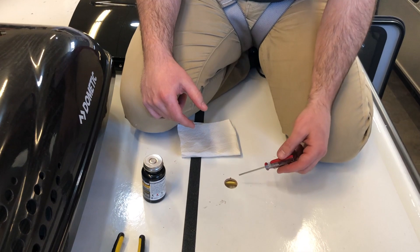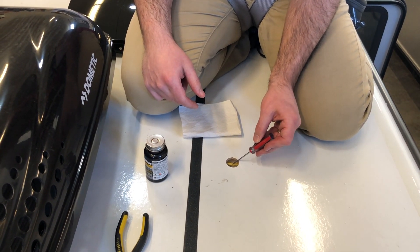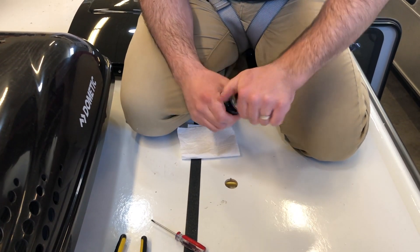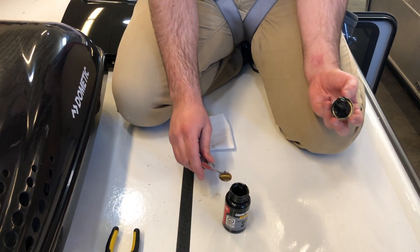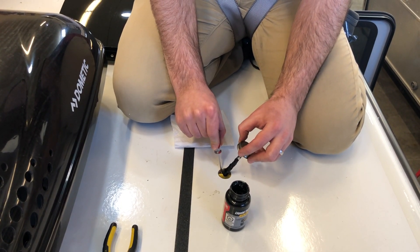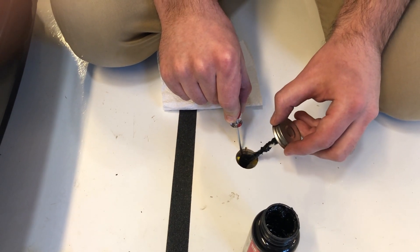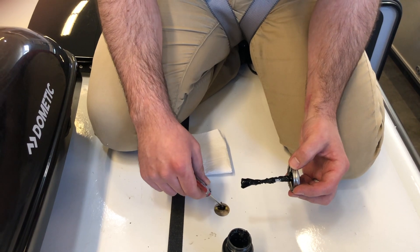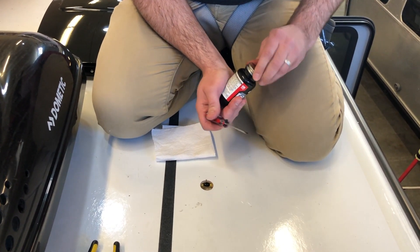Back on the roof, we've got a hole that goes all the way through now, but we still have to repair the little boo-boo on the wire. We have not penetrated through the actual AC wiring, just the casing, thankfully. So we're going to repair that very easily using liquid electrical tape. This stuff is pretty toxic, so don't breathe it — use it in a really well-ventilated area, and definitely wear gloves. We're going to pull the wire out and get a little coating on the actual split piece. It's ideal if this stuff penetrates a little bit so we can really ensure it's coating the hole. This is more precautionary but we do like to be safe. Now that I've got that on there, just going to let it go back down to its position and let this dry — it should take a few hours.